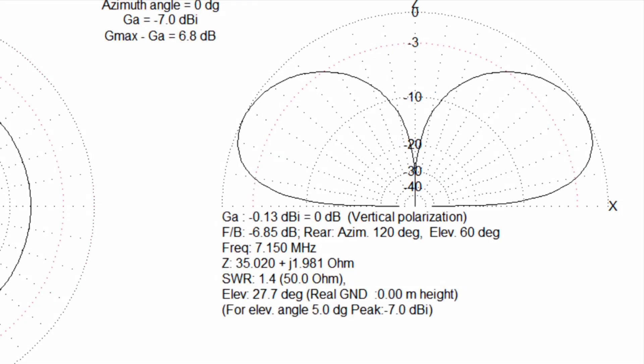When we look at 40 meters, the figure's minus 7 dB again at 5 degrees. For those angles this antenna is around about 1.5 to 1 dB just down on a quarter wave — so negligible, and it'll perform very well indeed as a vertical. My contacts on the day were made on 40 meters, because that's the band I really wanted to test. I know on 20 meters this is going to be a very good quarter wave vertical, no problem. On 40, it's about two thirds the size of a quarter wave. Let's see how well it did on the day.